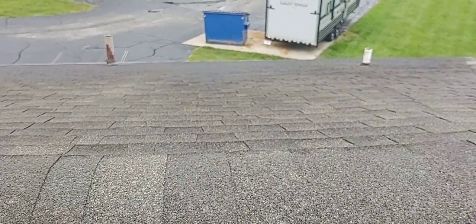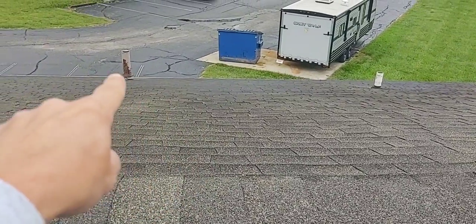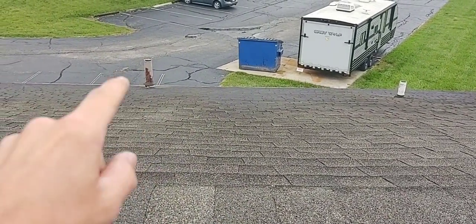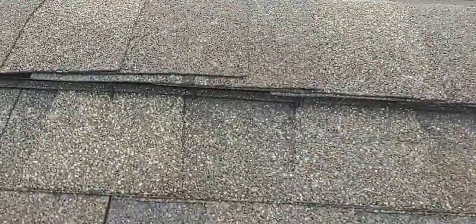Today's been a busy day. Yesterday, call volume was increased a lot. We had a lot of rain in the area, and there's a leak back in this section. It's pretty obvious — that vent stack is missing a cap on top, and the flange is flipped up right over the leak. That's the issue there.